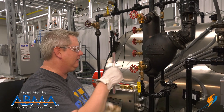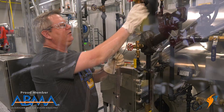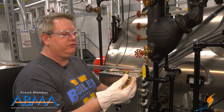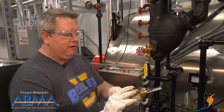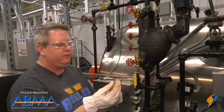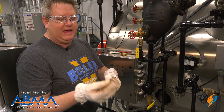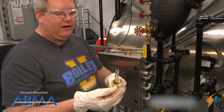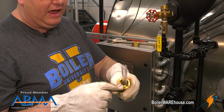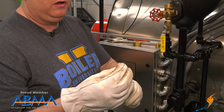I'll pull that back off and get these gaskets ready. The brass nut's purpose is obvious — it screws up against that and compresses our gasket. These brass washers actually do two functions: one is they compress the gasket against the internal seating surfaces, and the second is they eliminate friction between the ring and the gasket. On some of these you'll have a little thin copper gasket, but in this case we've got a beveled brass insert that's going to help compress that.